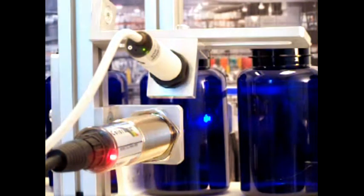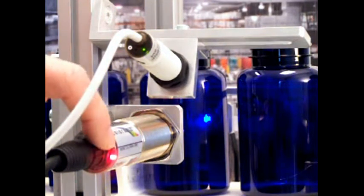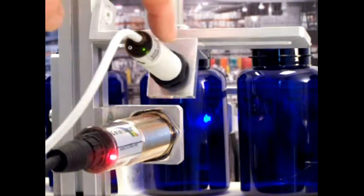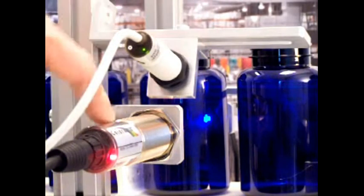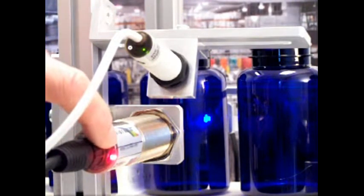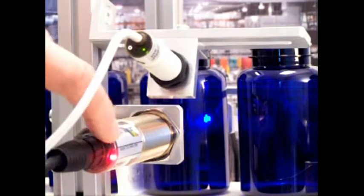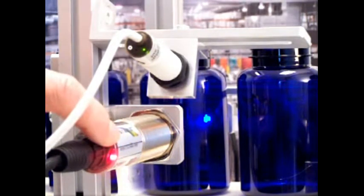Now that we have the sensor programmed, let's check it out in a real-world online application. We set the sensor up over a conveyor. The red LED on the sensor indicates a match to the color that we programmed in earlier. The laser mark sensor detects the edge of a container while it is positioned properly in front of the sensor, signaling the sensor to take a color measurement and latch its output readings. Whenever the LED on the sensor is red, it indicates that the containers are matching the pre-programmed color. Whenever it turns green, it indicates that the container does not match the pre-programmed color.